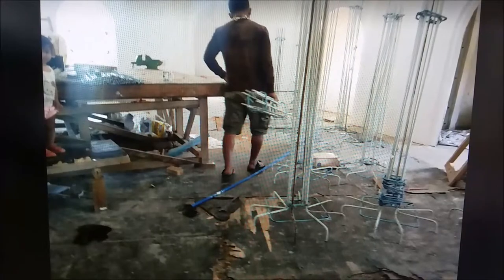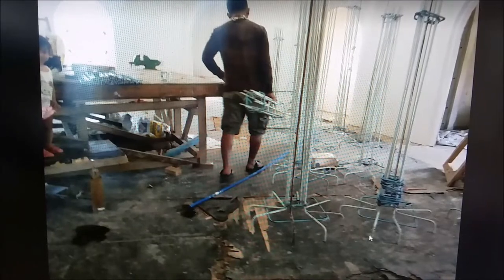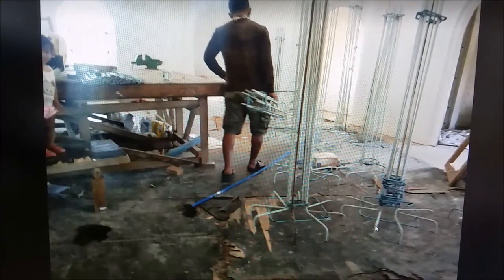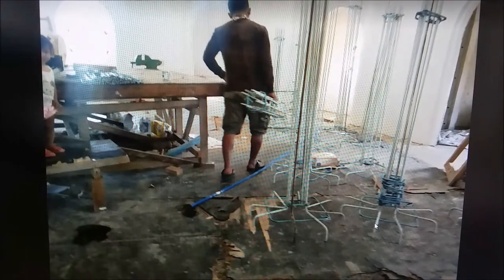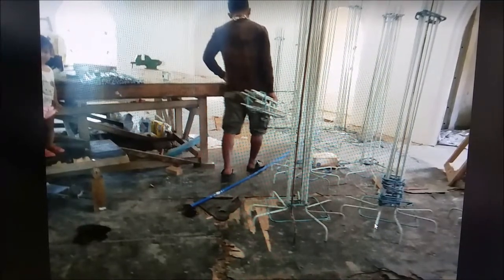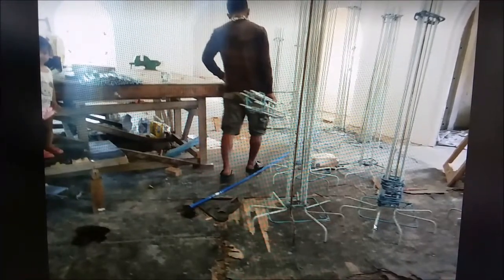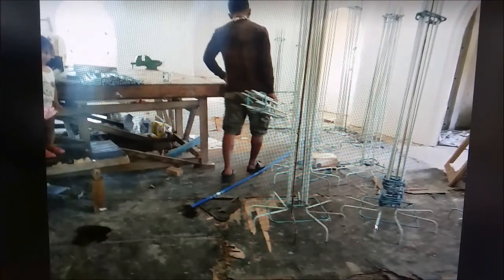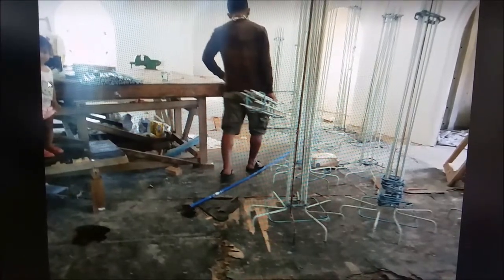Here's Nanny again. What he's making are vertical columns — the ones fanned out on the bottom will sit on those little parts hanging down, and the thing will sit nearly plumb. Just drop it into the hole — we're going to put three inches of concrete in the bottom. That'll be set level using the water tube transit they use here. I've got a laser level for them and I taught them how to use the surveyor transit, but they prefer the plastic tube. I mean, I get the laser level out — I'm totally lazy.